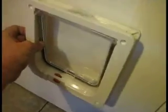cut accordingly. Now, one of the differences on this door is it's one of the older doors. It's not just simply flat. It has this kind of molding piece on the sides and the bottom, and it's thinner in the middle. I want to put the door not centered but on this side, but you've got to be careful with the edges. You drill your holes here, but remember those are just where the holes are, and then you're going to butt to here. So you want to offset that template a little bit to make room for the edge here.